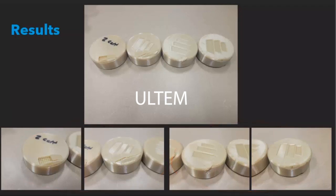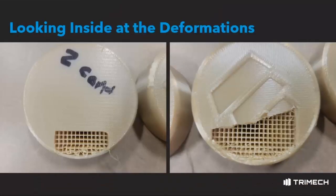With these two repeated results, we can understand that the infill geometry and density is directly correlated to the part's ability to withstand plastic deformation when an impact load is applied. In order to better visualize what's actually happening inside the part, we peeled back the top layers of the broken sparse filled parts. We can see that the rasters inside the part deformed at the location of the impact. If we were to have more rasters or a stronger raster pattern, we would likely have a greater resistance to the plastic deformation of each raster when the same loading conditions are applied.